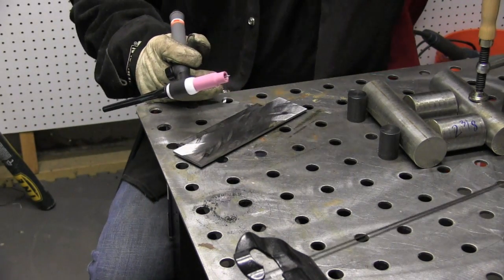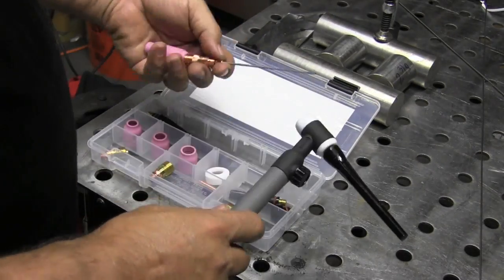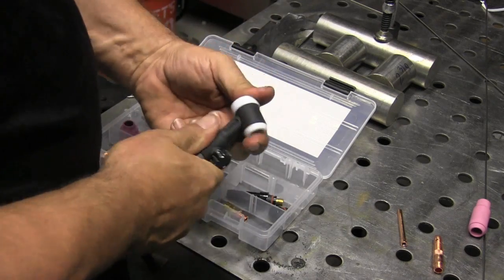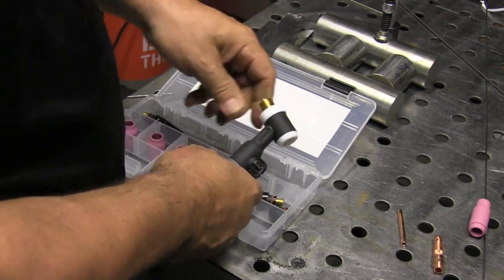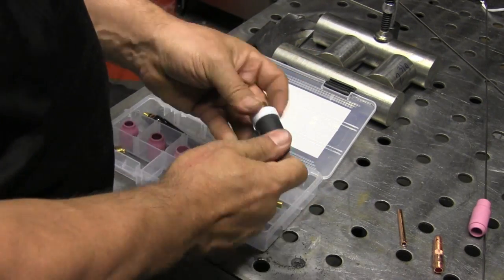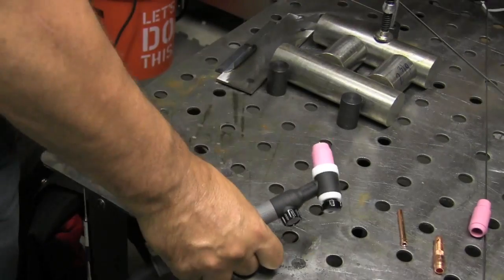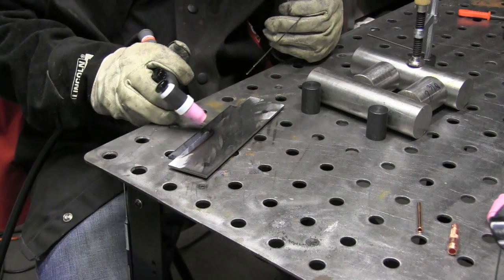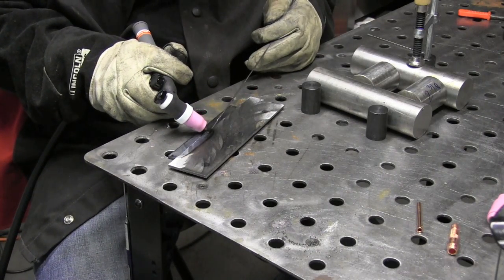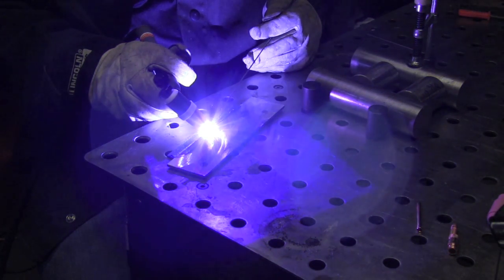We're doing lift arc TIG here, and I don't like the regular style cup that comes with these big number 17 torches. Once you get used to a small torch and haven't spent a lot of years in the aviation aircraft industry, it's really tough to get used to the big setup again. The stubby gas lens will take an air cooled 17 and shrink it down, providing good gas coverage using the gas lens and make it almost as good as a number 9 style cup. You don't have to have a water cooler, and you've got a nice maneuverable torch with a very low profile and really good gas coverage. I bring that up not just because I sell these on the Weld Monger store, but I just really love them — they work a lot better, they feel better, and they get into tighter places.